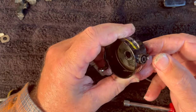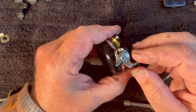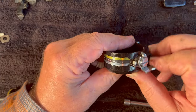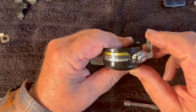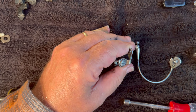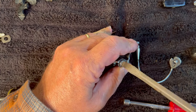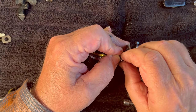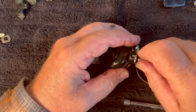But it is dirty and we'll have to scrub it. Let's go to this side — this side is also spring-loaded. It's got a bump stop here. If your bale wire is going down too far, you might want to look and see if you have that plastic bale bump stop, because it may be missing. Let's go ahead and get a bigger screwdriver on this screw. I'm going to peel it pushing out — bring it up, let the tension come off of it, and then take the screw out the rest of the way.